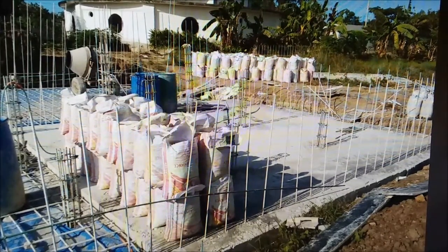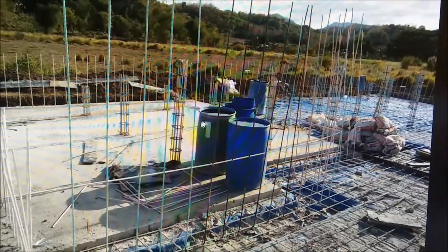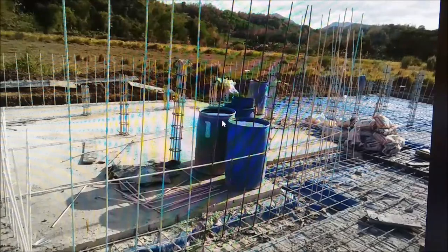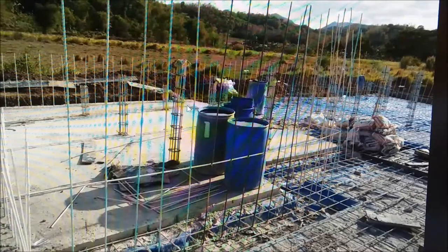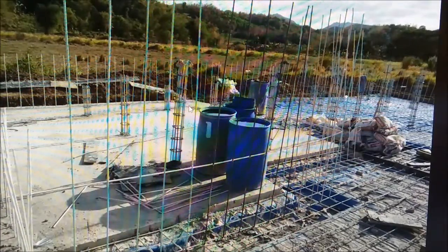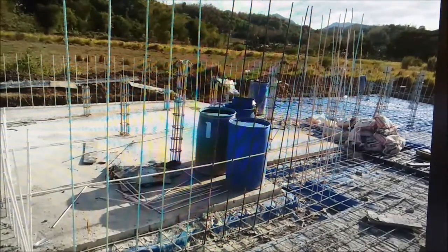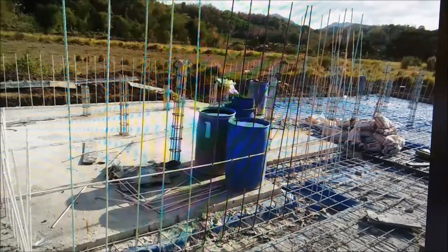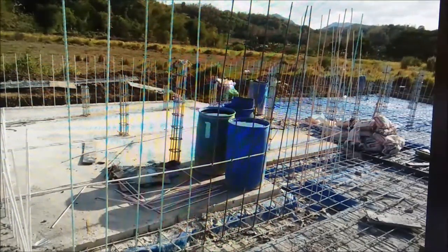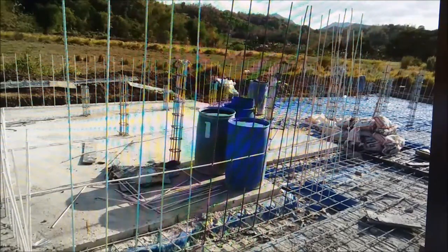Next picture — you've got some water barrels filled up. I'm not sure where they took those bags. This is where we're at; there's that other water barrel. Again here on the outside of the rebars, this area didn't get finished very well. We may have to chip that before we put the foam down — it's usable, it's just it would be nice if they had troweled it.